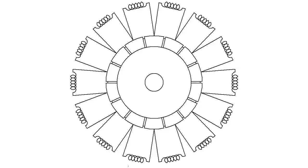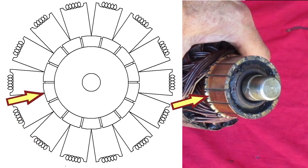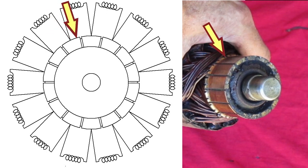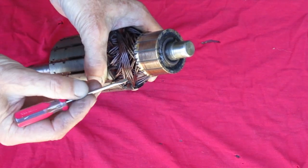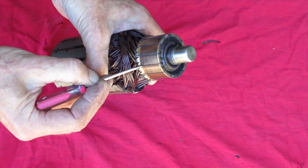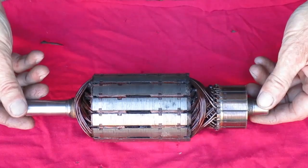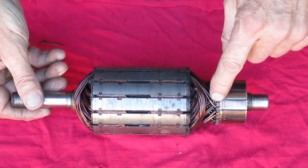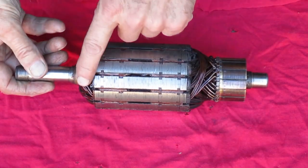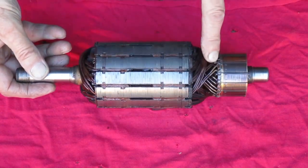This is a generic picture showing how an armature is wired. You're looking at the commutator end of the armature — this is the ring of commutator bars. Each one of these curly lines represents an individual coil in the armature. Each commutator bar is electrically insulated from the others, and each commutator bar is connected to two coils. Looking at the end of each commutator bar, there are two wires connected. You just have to imagine all those coils wrap around somehow and end up connected back to the commutator bar that's next to the one where it started.